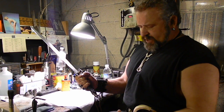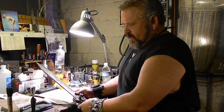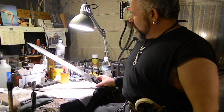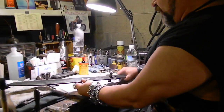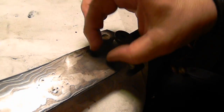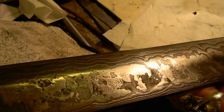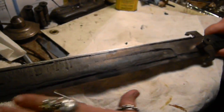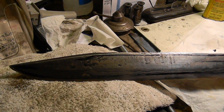On a blade like this, you need a handle at least that long, which I told him. But he wanted a shorter handle because they do the moves — the twirling stuff and everything. It's really a neat piece of Damascus. This is a piece of mild steel for the handle up in through here. Can you see where it meets right there? It's hammer forged in, then you go to Damascus, and it's tougher than shit. I'm going to be grinding it down, take that much off, maybe do a feather grind on it. It's going to be cool.